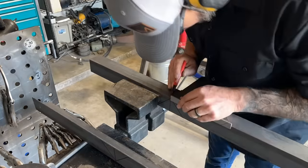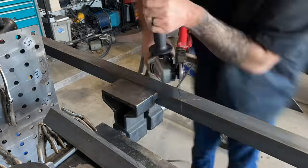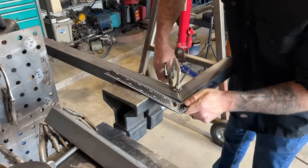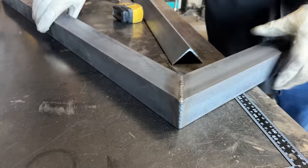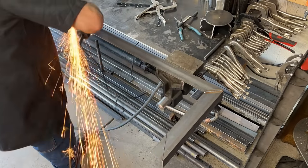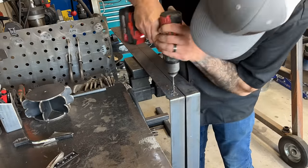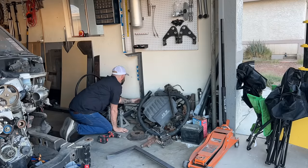I'm going to make each L bracket from one piece of angle iron. In order to get an L shape, I'll remove a 90 degree wedge from one wall, score the other wall, bend it, and weld it. I'm going to trim off the corners so I don't snag any clothing or flesh when I walk by. These brackets will be held to the wall studs with lag bolts. Most of the stress should be at the top, so I'll put 2 bolts close together there and 1 closer to the bottom.